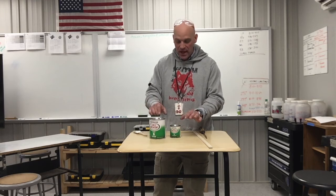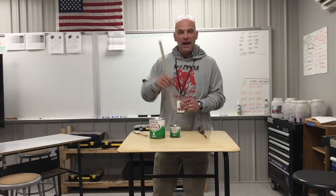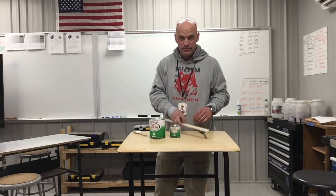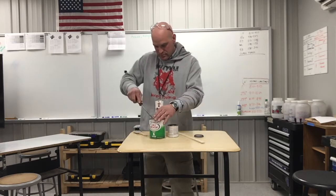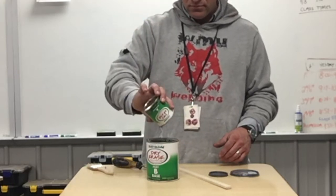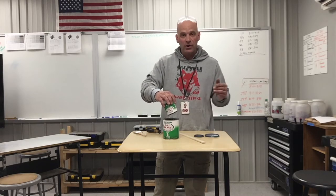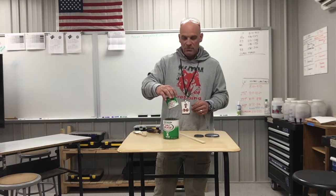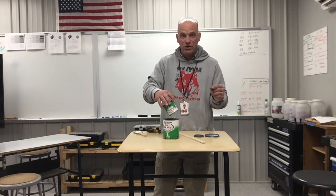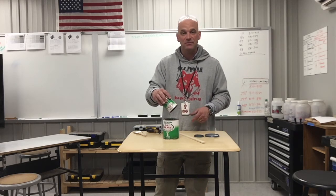Now I need to mix part A and part B. So I'm going to open both cans, pour part A into part B, and mix it until it's all a uniform color. Then I'm going to start brushing right on. The box says to mix for 2 minutes, so I'll go ahead and do that. I'll mix for 2 minutes, make sure it's a uniform color and consistency. Then I will brush it on. It says to make sure to use this within 60 minutes of activating it, of mixing them together.